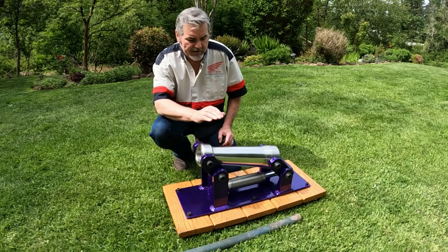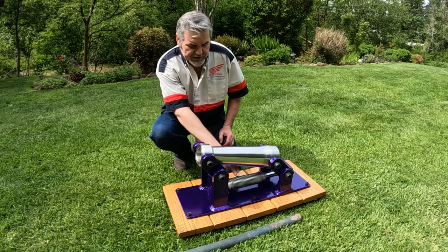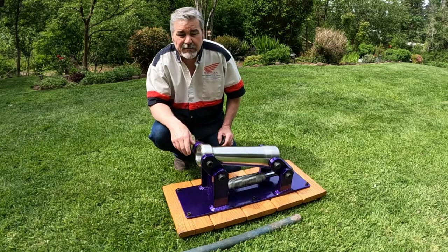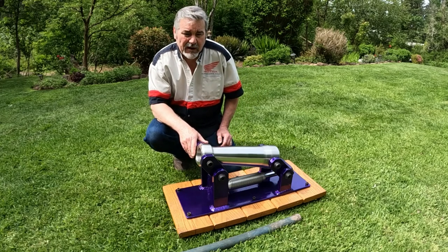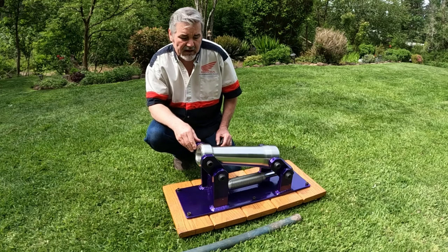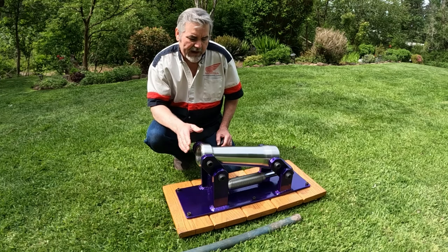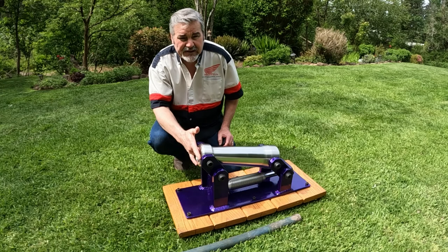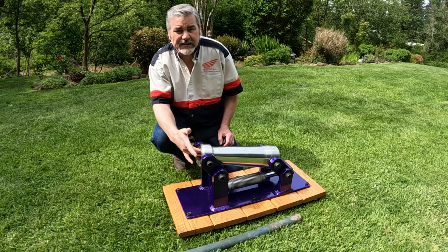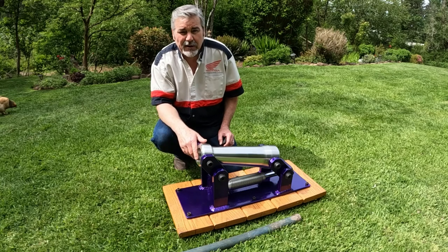So what we have here is a stainless steel barrel. I've got it set up on a recoil — the shock down here is off my dad's old dune buggy. After he passed away, we sold the buggy and kept some extra parts off of it, so I figured I'd put that shock on there and make it out of stainless so it lasts forever. It's got a 15 and a half inch long internal bore with an inch and seven eighths diameter, and then the last couple of inches are bored out to two and a half inches — that's for putting tennis balls, beer cans full of sand, whatever you want to put in there.